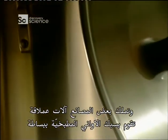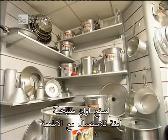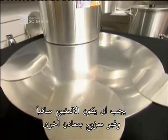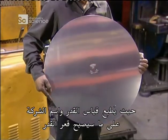Some factories have giant machines that simply stamp out or mould the cookware, while others use a technique called metal spinning. To make cookware that's safe for food use, the aluminium must be pure, with no other metals mixed in. It all starts with a round aluminium sheet called a blank, where the pot size and company name are stamped onto what will be the bottom of the pot.